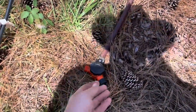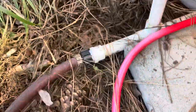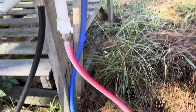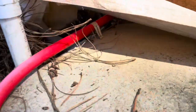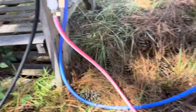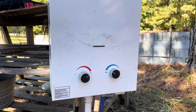All right, so we're going to start with our source coming in. We run a water hose to here, which goes into the actual PVC in the tent and hooks up there. And then it has a T on it. That T feeds the blue, the cold water, to the gas water heater. And then the red line back to the tent feeds a whole other piece of PVC in there that all of my hot water lines come off of to the sinks. So pretty simple, and this thing works great. It will heat the water in about 20 seconds after you turn the valve on. Pretty good stuff, but I'll leave the links in the description down below.